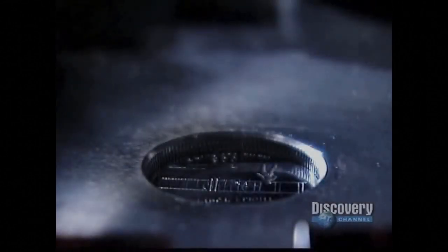The coins are struck on special presses which stamp the head and the tail simultaneously. We can understand the process better by slowing it down. The die for the tail is mounted inside this well. When a blank slides in, the press drives the head die down with over 90 tons of pressure.